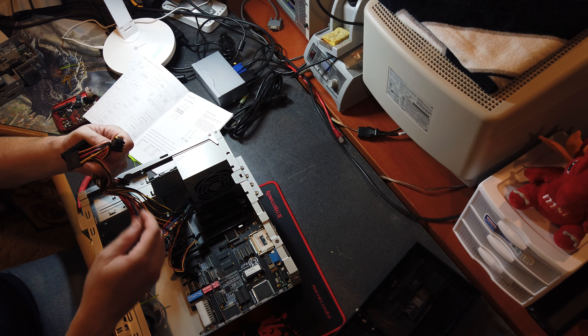My original plan with this build - which is why I wanted a really long cable - was to run a 5.25 inch drive up here and a 3.5 inch drive here. But this cable is not long enough. That might work, although this would have to be drive A. Assuming I don't need to flip it over - which I'm sure I will - we can put this one down here, and this might just reach to the 5.25 inch drive sitting right there.